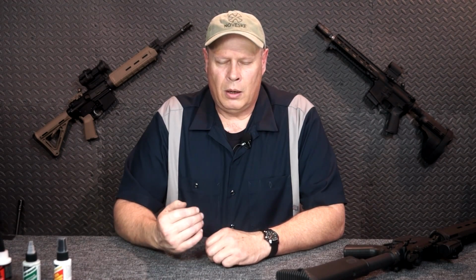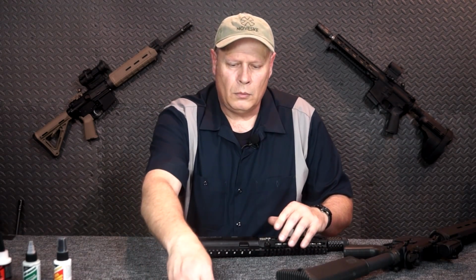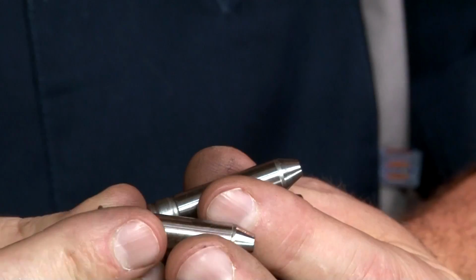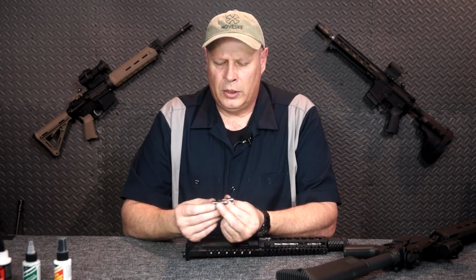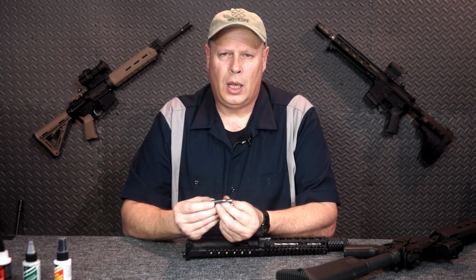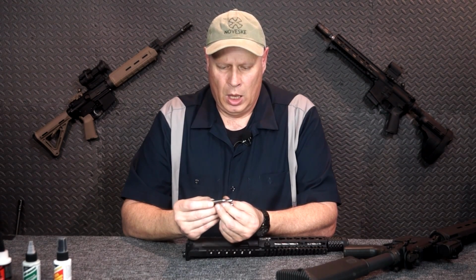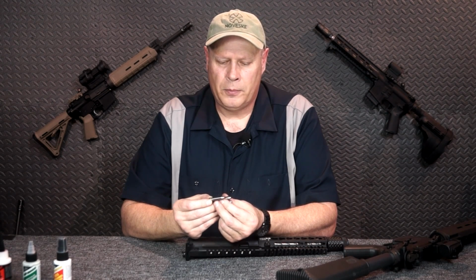It's easy. Look at the hammer. Is it broken? Nope. How's the spring? Nope, looks good. But some of the things that are less than self-explanatory are things like headspace. I have here 3 headspace gauges. I talked to you about this during the tools, and I believe them to be an essential item for an armorer. They come as go, no-go, and field.